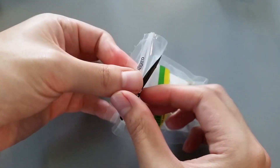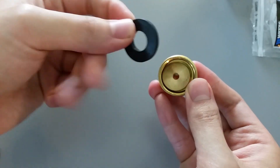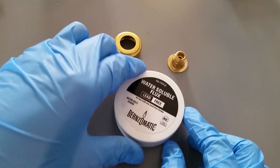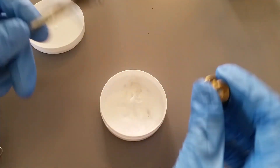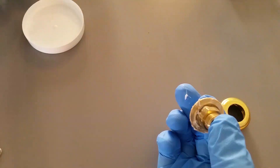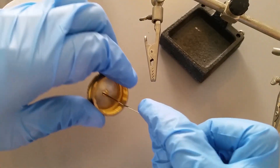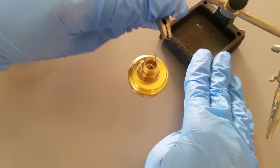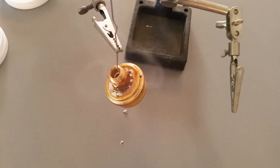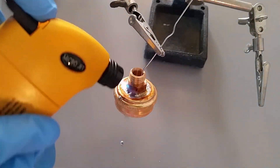First you'll need a quarter-inch hose adapter — I got mine from Home Depot. We'll remove the o-ring and solder the two parts together. Brush flux onto the mating surfaces; don't be shy with the flux, you should use more than you see here. Next I used a paper clip to hang the two parts together. Then I used a butane torch to heat the parts, but it was a little too cold — a propane torch may be better. Make sure your solder joint goes all the way around. When you're done, clean the adapter with a wet paper towel and set it aside.